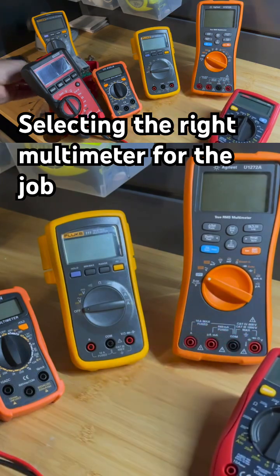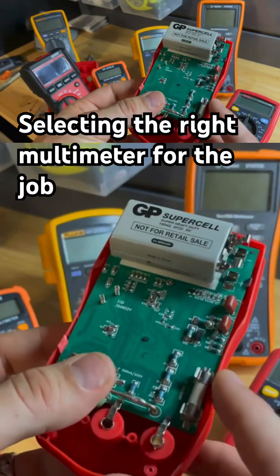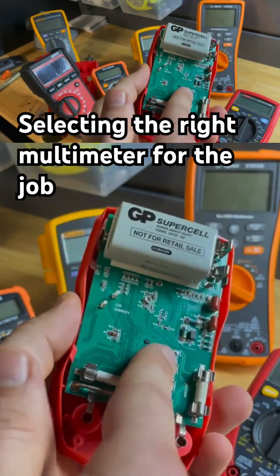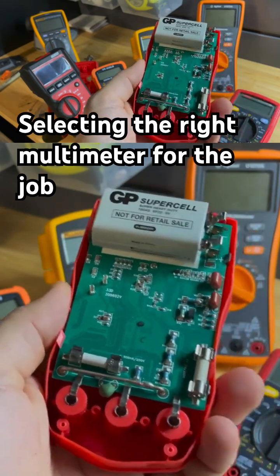It's just not designed properly for that. We could go into a whole explanation — taking it apart and looking at why it's not, how it's not fused in certain locations, and how this resistor is just going to blow up once you put more than 500 milliamps of current through it.